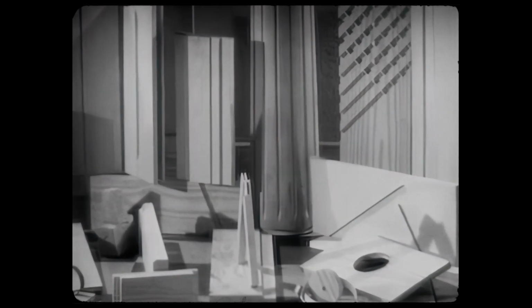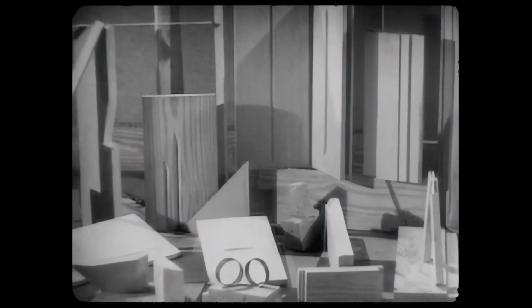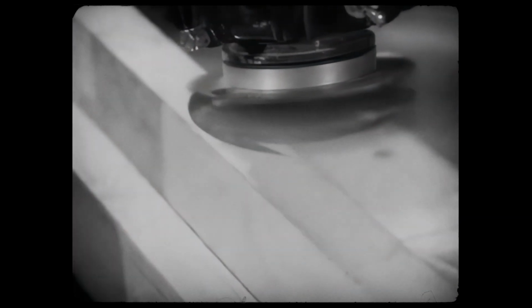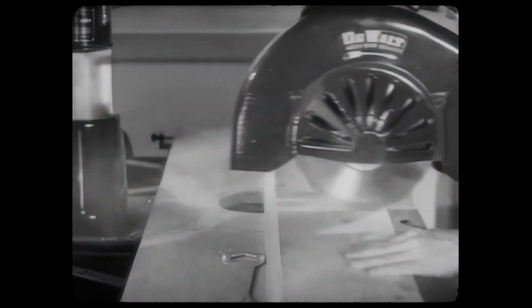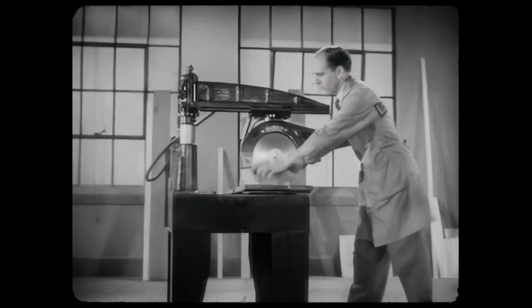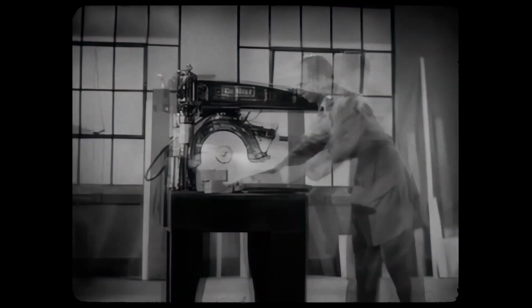Since a DeWalt can do practically every job of which most types of manually operated woodworking machines are capable, it will pay increased dividends because it is seldom idle. If any company's manually operated sawing, dadoing, and shaping machines are all working all of the time, each of those machines can be replaced by a DeWalt with an increase in production because of flexibility to take care of peak volumes on any operation, reduction of material handling because all tools are adjusted to the material, resulting in a reduction of floor space required. As an example, if your woodworking department had 9 machines, 3 cut-off, 2 rip, 2 dados, 2 shapers, and these machines were all DeWalts, they could be converted at will into 9 cut-off saws, 9 rip saws, 9 dado machines, or 9 shapers.